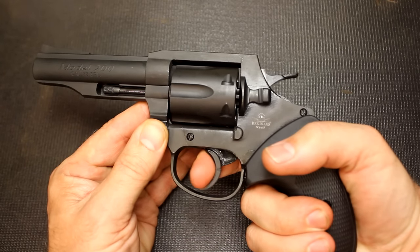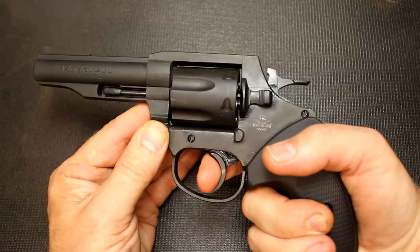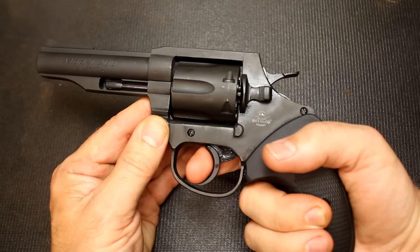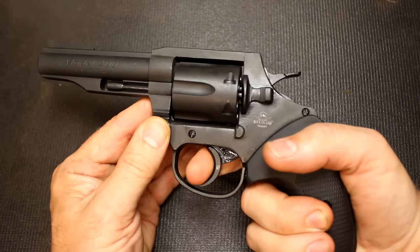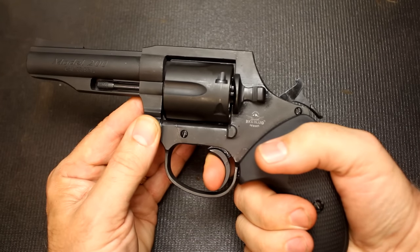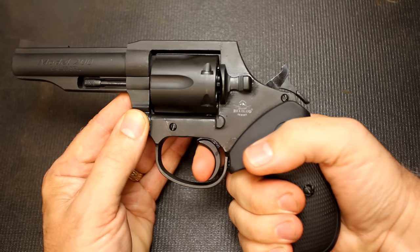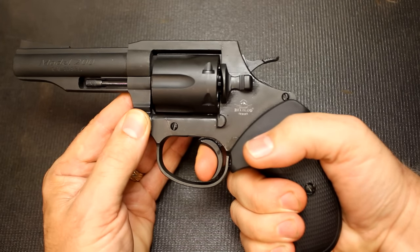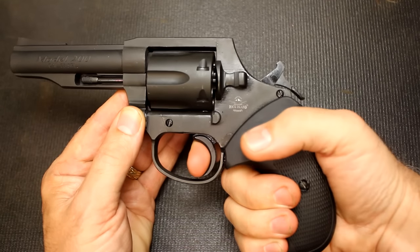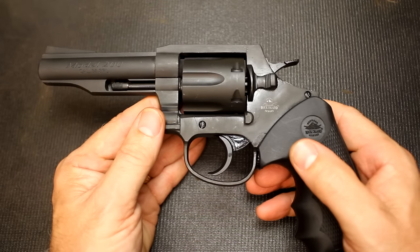The grips are two-piece - just with a flathead screwdriver you can remove them. It uses a standard coil spring instead of a flat spring that the old Colts used, which is more modern in design like the Smith & Wesson. One big difference I noticed with the Model 206 is that the muzzle is crowned, but on the 4-inch Model 200 it's not crowned. That's important because crowning really helps with accuracy and keeps that muzzle from getting dinged. As far as the trigger pull action - double action is just really smooth, and that's going to allow for really good accuracy even with a fairly heavy trigger pull. Single action is very crisp with no over-travel and no play.